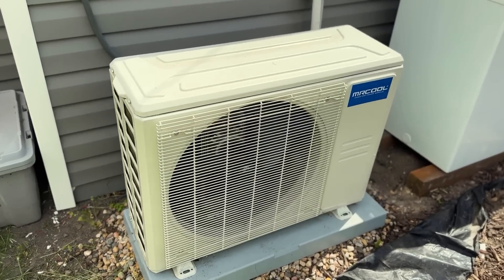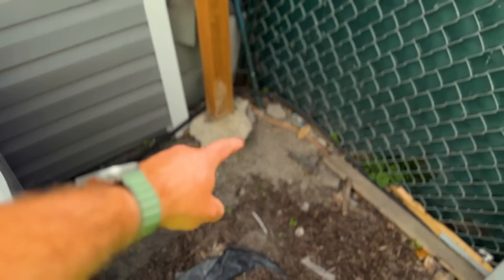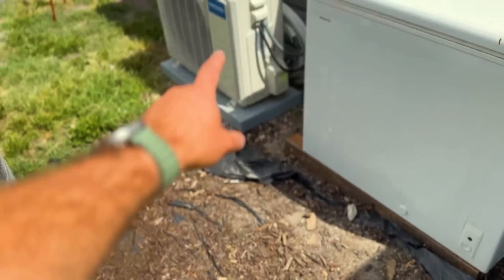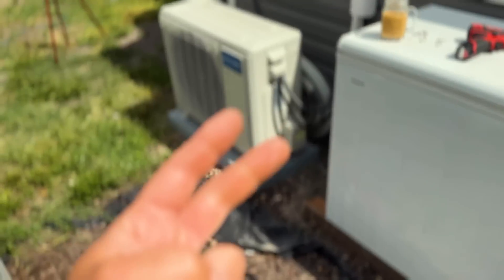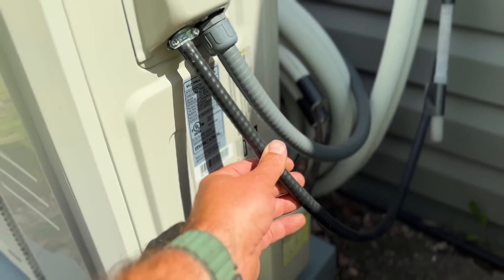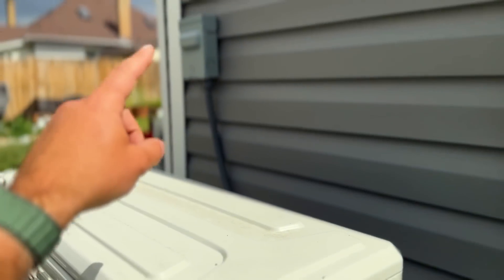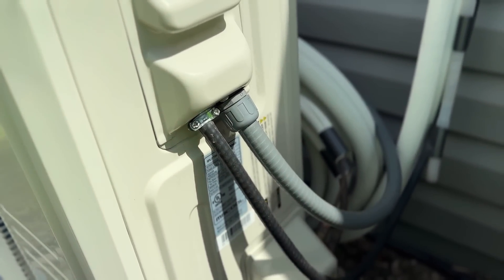This is the unit we're going to be moving. As you can see back here, we have a bunch of spooled lines, so we should have plenty of length to move it over. We're going to be putting it right here — we're redoing this fence, but I want to put this mini split here for videos. The lines we won't have to extend; we just detach and reconnect. But the electrical we're going to have to extend — we'll run new wire from our box through new half-inch conduit.